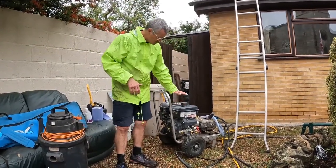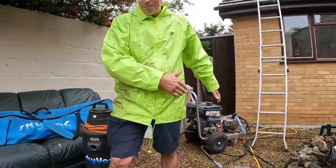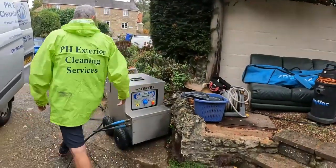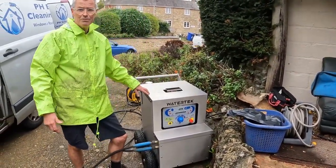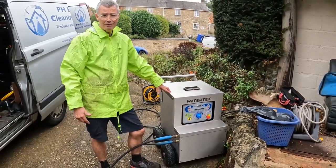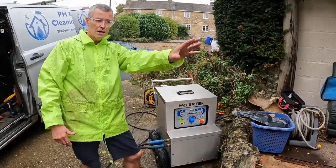The actual pressure washer is a Briggs & Stratton 21 litre per minute machine, so it's a nice powerful machine. And it pumps the water under pressure at 21 litres per minute into this box. This is called a hot box. It's a Watertek brand from Rutland Pumps, and its maximum throughput is 25 litres per minute. So because my pressure washer is 21 litres per minute, this is more than capable of coping with the pressure